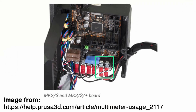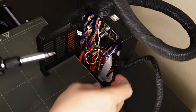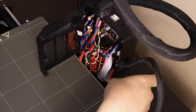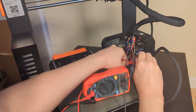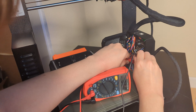At this point I was stumped and got on a chat with Prusa support, sending them a detailed list of everything I had done. The support agent suggested checking the voltage of the heater on the board itself with the heater wires disconnected. So I turned off the printer, disconnected the heater wires from the board, turned it back on, and carefully placed the multimeter pins on the heater pins on the board. The voltage showed 0.1V, when it should have been about 24V.